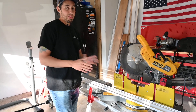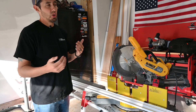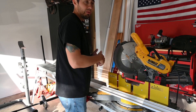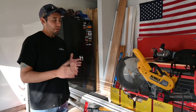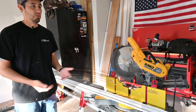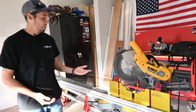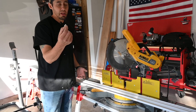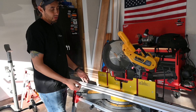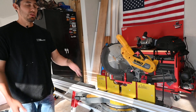What's really cool about cutting crown this way — I haven't done it yet, so I'll let you guys know how I like it — but the one advantage I see right off the bat is that a lot of times me and John are trying to perform two different tasks, one of them being crown molding, and that crown molding jig is in the way. For example, I'm cutting crown and John is cutting casing, and with that crown stop jig in the way he has to move it to cut casing, and then we have to reset it. Whereas with this system already set in place, you could just take this plastic clip and move it to a slot right there, or a lot of times it wouldn't even be in the way because when you're cutting casing it won't be up that high — but the crown stop jig would be. These are the struggles of a trim carpenter.